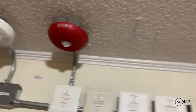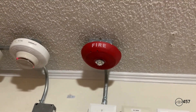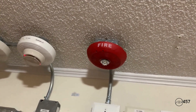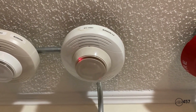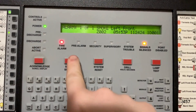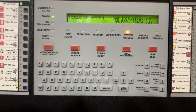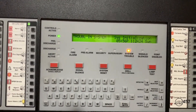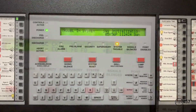I am so stupid — I accidentally forgot to put the ceiling mounts on selective silence so that they will continue to flash when I silence the system. Here is the smoke detector on the B200SR-LF sounder base activated. And to reset it, all we're going to do is hit system reset. And I will go ahead and put the ceiling mounts on selective silence.